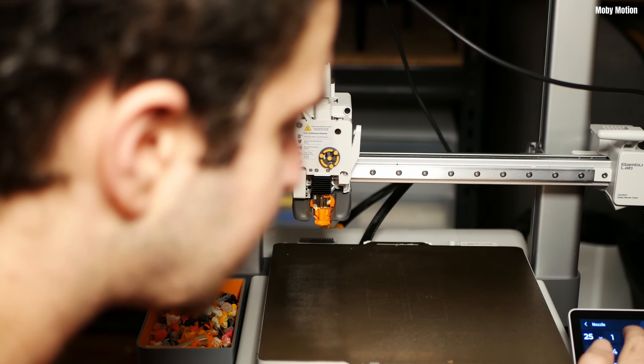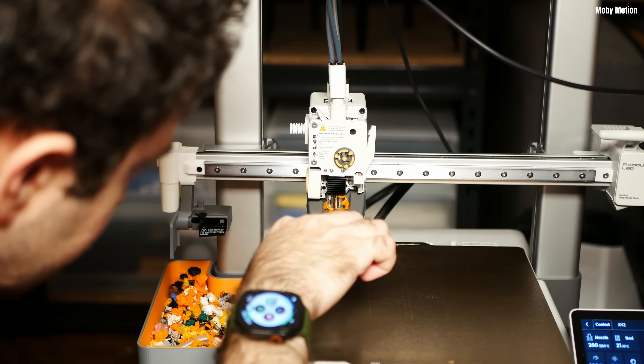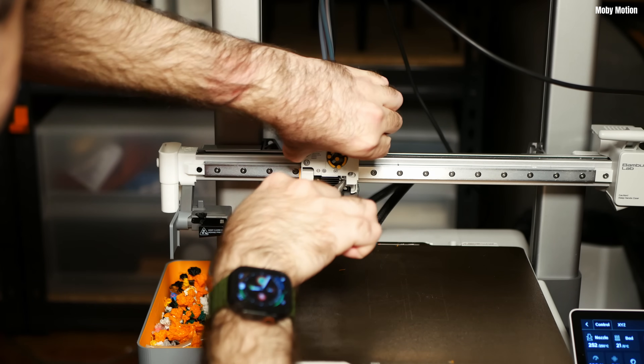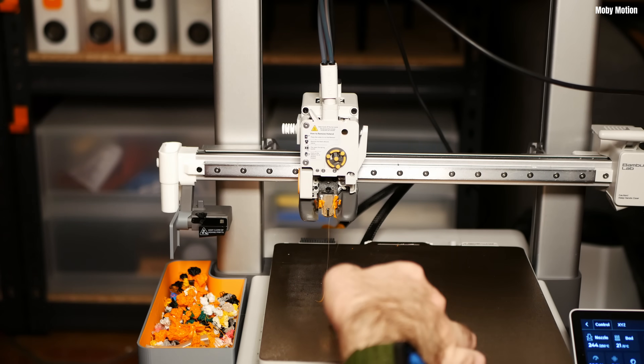I was able to get chunks off but there was still a lot on, and plastic that was attached too tightly, so I knew I had to heat up the nozzle. I heated it up to 250 degrees — that's what Bambu recommends for PLA in their article, slightly hotter than the temperature you need for printing. I was able to get off the vast majority of it in terms of filament volume just by heating the nozzle. The guidance says to put the printer into maintenance mode so you can heat it up even without a nozzle attached, but I wanted to see if I could get away without it.